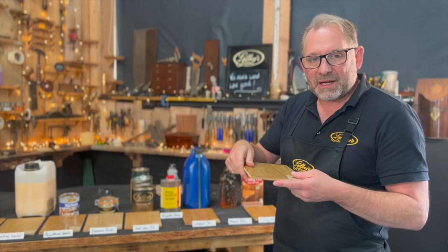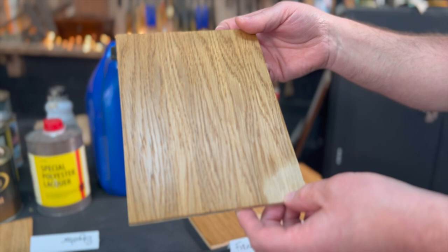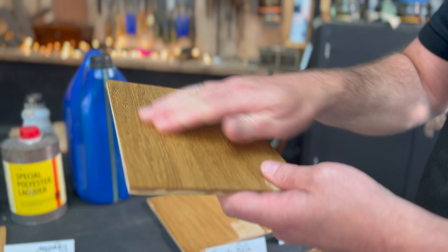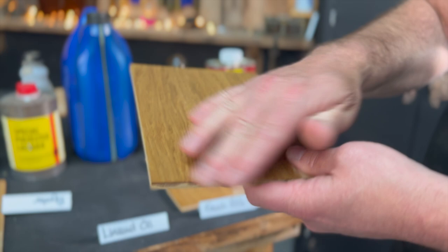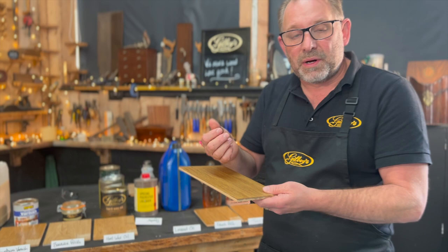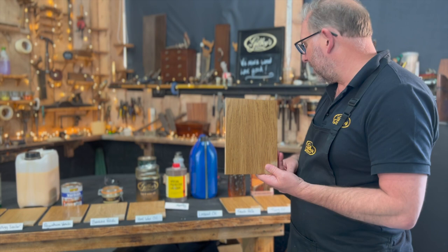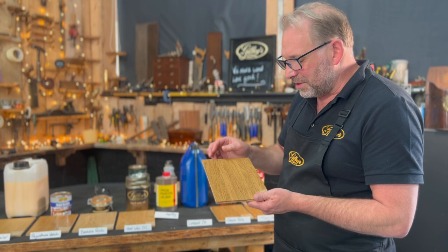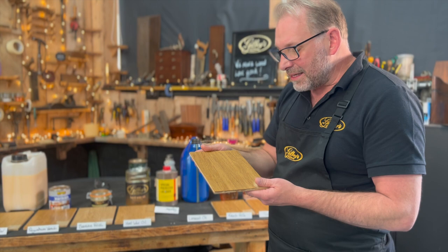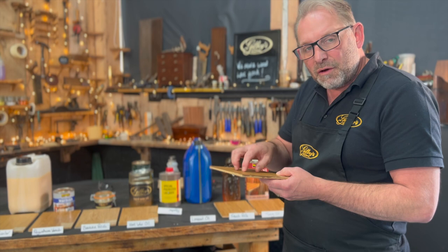Linseed oil — the go-to finish for many people for years and years. It's still not dry even after wiping it clear, and that's boiled linseed oil — the one that should dry quicker. As a practical finish we wouldn't use this in the workshop too much unless you've got a project extended over days. All these oil-based coatings penetrate deep into the wood — they really get soaked and absorbed in. So there's not much of a film coating at all.